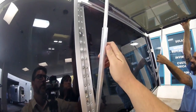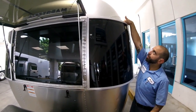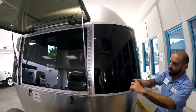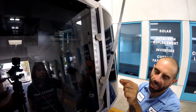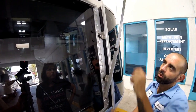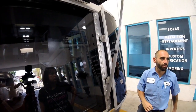The side ones are identical — these are just shields, but the top is kind of open, so leaves and dirt get in here over time. The way you clean it out is with these two screws — they're not actually screws, they're like quarter-turn locks. You just turn them a quarter turn and they come off both sides, then it swings open. You pick it up, take it out of the hinge, wipe it down, and go back. Very easy.